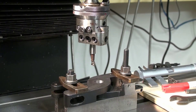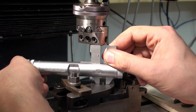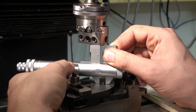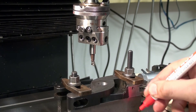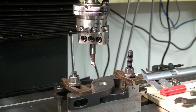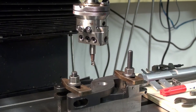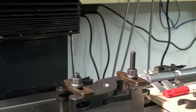This last cut gave us a bit better surface finish as it was a pretty shallow cut. This tool also is not the greatest — I should have sharpened it before. We over-cut slightly: we have 13.52 millimeters, which is about one thou oversized for the inch folks. I can live with it — this is just a pivoting pin, and it's way better than the original bore, which was neither round nor on size.